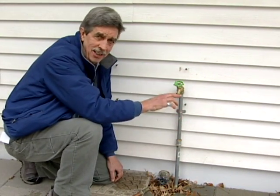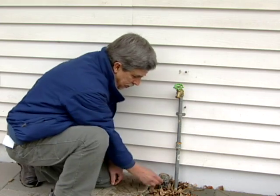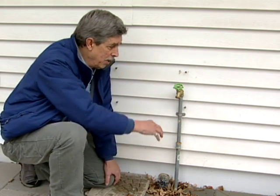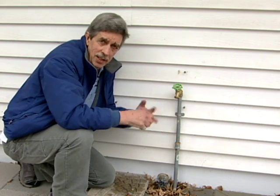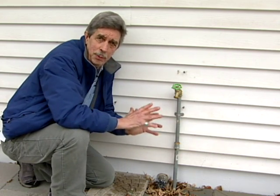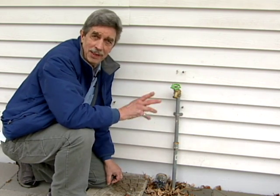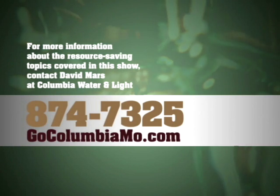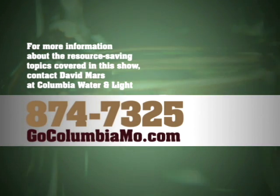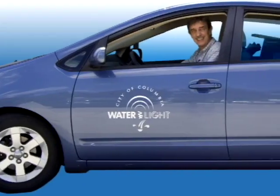Now, it looks as though the water is coming out where it should, but it's actually coming out of a fissure that occurred when this particular plumbing piece broke. It had a freeze-proof valve down below, which was fine, but if this would occur inside your wall inside your house, you can imagine what kind of damage it would do. So try to do your sealing, police the area, make sure you've got any cold air coming in where you don't want it. Insulate, put some heat tape on — take care of the matter, because we don't want you to waste money on a bad plumbing bill and a big leak. Dave Mars with Conservation Tips — see you next time.